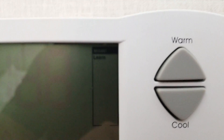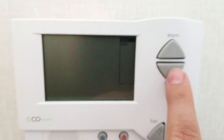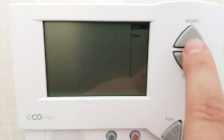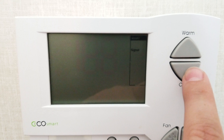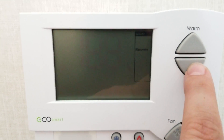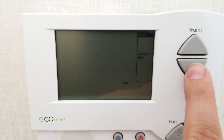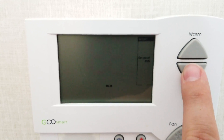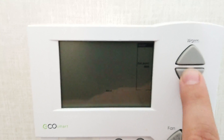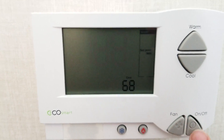It says 'Maintenance' at the top, and 'Learn,' and then you can go through the menu. You get 'Erase,' 'Signal Recovery,' 'Set Max Point for Heat,' 'Set Max Point for Cooling' — that's how high they'll go. But we want to get over to the 'Heat Set Min Point' and the 'Cooling Set Min Point,' so you come over here and press the on button.